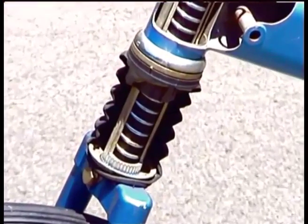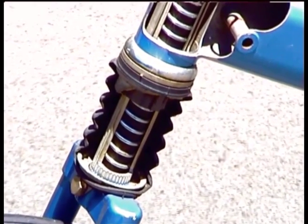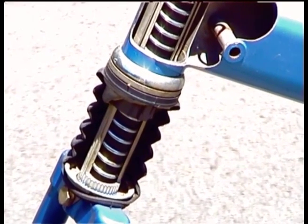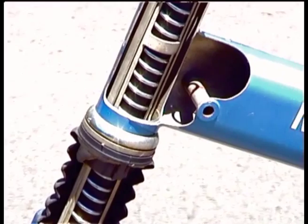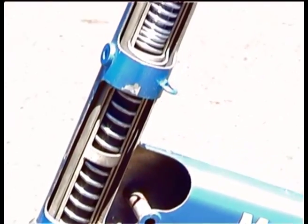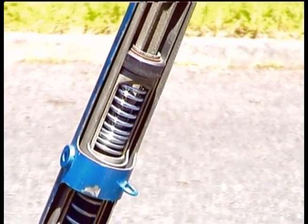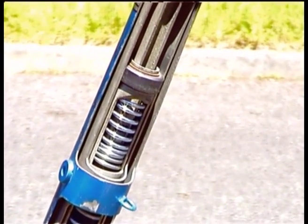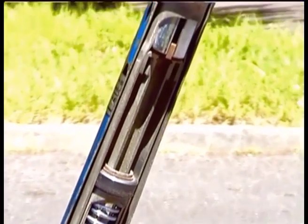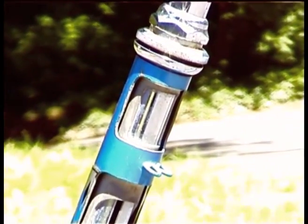Now, we saw a few minutes ago when Keith revealed it to us, the front suspension. Here you can see what's going on inside, the main steel coil spring with a rubber column inside, and you can see the nylon bush there. Then you can look a little bit higher up, see the frame junction between the main beam and the head, right up to the top, and you can see a little spring at the top with tighter windings. That's the rebound spring to allow the suspension to go down lower than the normal rest position when it's bouncing back from shock, and way up into the top of the head tube there and the top race.